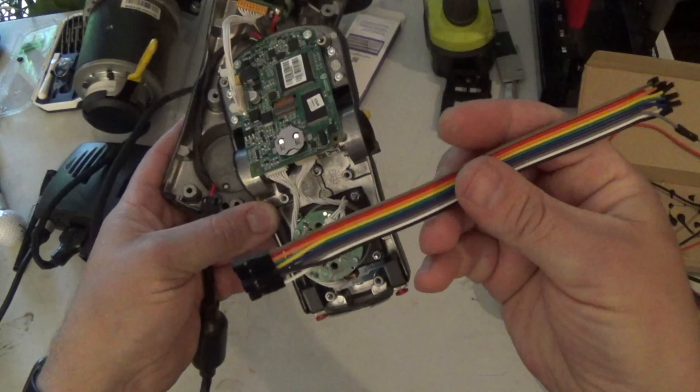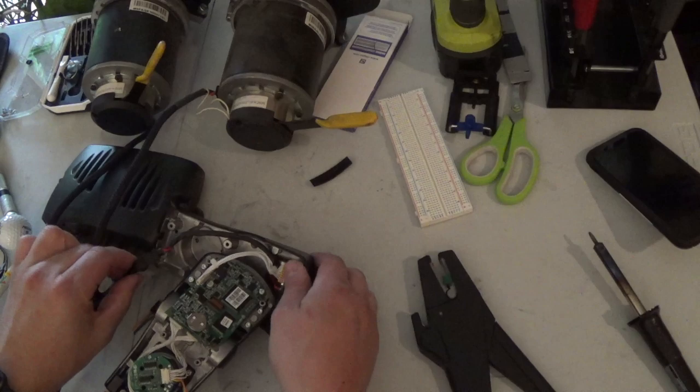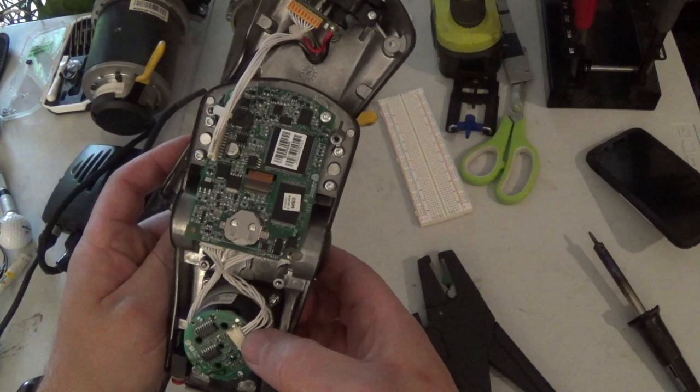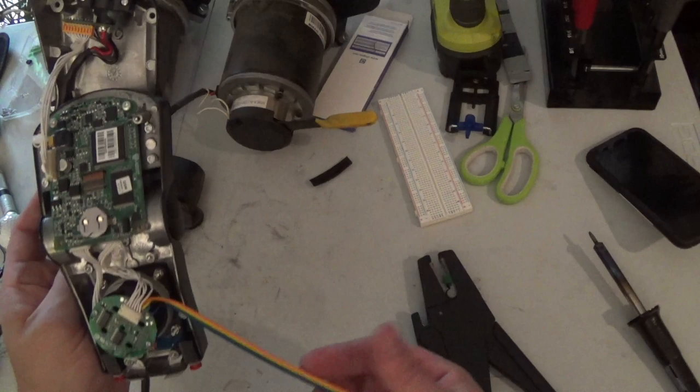Okay, that was actually a little easier than I thought it would be. I found some probe points underneath this connector, so all I had to do was pull the connector off and then solder on our interface cables directly to those probe points, and then plug that back in, and it seems to hold everything down. So, yeah, cool. Now we can do some voltage checking on this. Although I probably should have put power and ground on there. And let me solder those on. Okay, we've got all our interface wires soldered up here now.